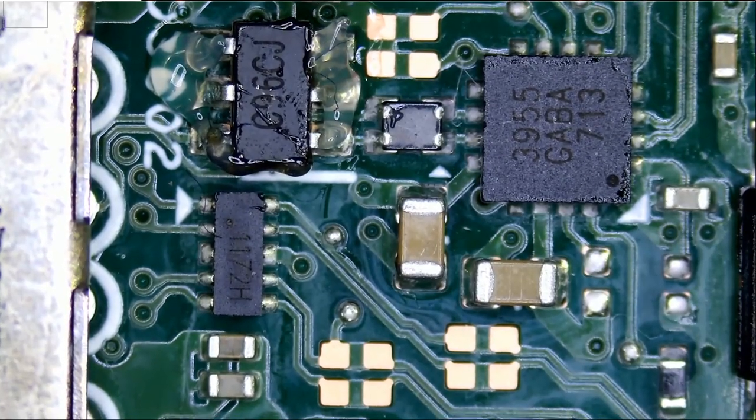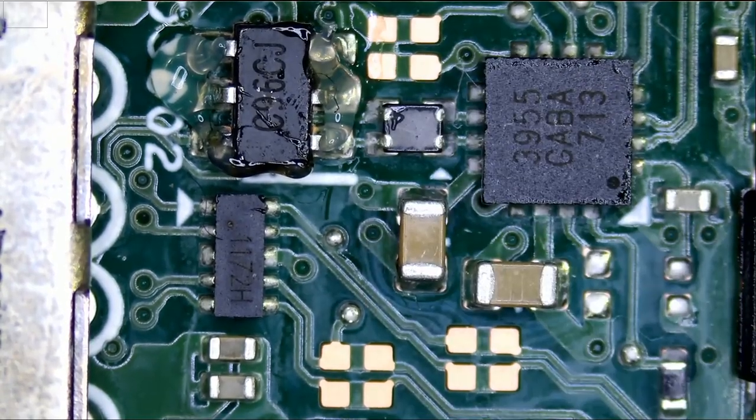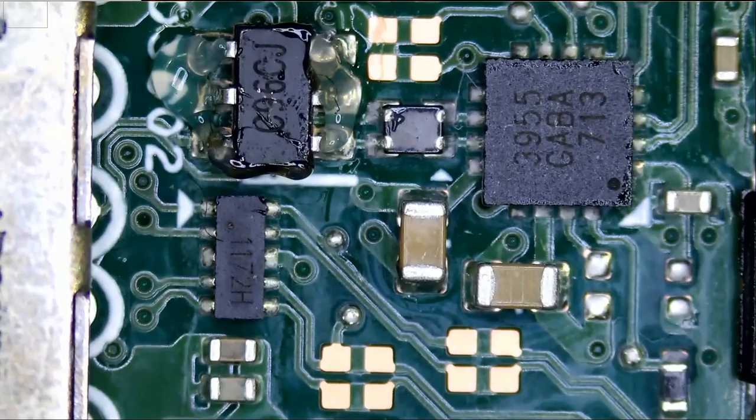If we use hot air, we may burn the keyboard under the board. We have to have the screen pointing down so it doesn't get burned. I do not want to take that risk right now, and I do not want to disassemble the board. So let's use low-melt solder to remove the chip. Since this is a power controller, it could be that this power controller is what's causing the short — very likely.